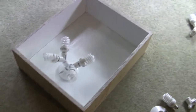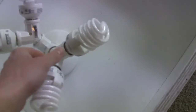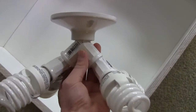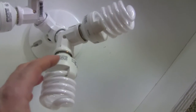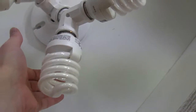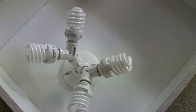This is the setup. I already had the box, which worked out great — I built it years ago because I was going to make an incubator out of it. I painted the inside of the box white. One thing I like about this design is it spreads the light out evenly throughout the box, and it also lays the bulbs a little flat, because the ballast can heat up and you want that heat to drift upward. You don't want the bulbs straight up and down because the heat will go into the ballast and shorten its lifespan.